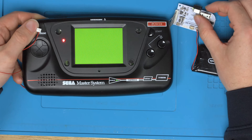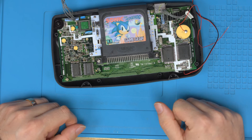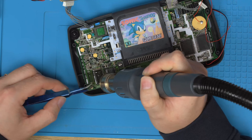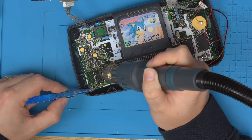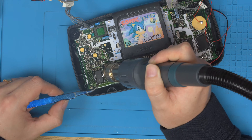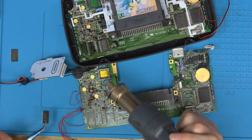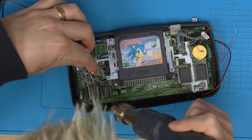Now we're getting a green screen, which means the MPU is possibly running — or it could mean bad soldering, or it could be work RAM. It might be that almost this whole board has died. Out of quickness, I'm just going to swap the RAM over. Bad RAM is normally very hard to diagnose — it'll typically be intermittent. Probing for RAM won't give you much information; the only thing you'd know from probing is bad traces. So I'm going for a lucky pass and just trying this RAM — it literally takes minutes to swap.